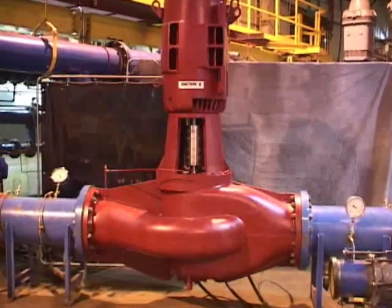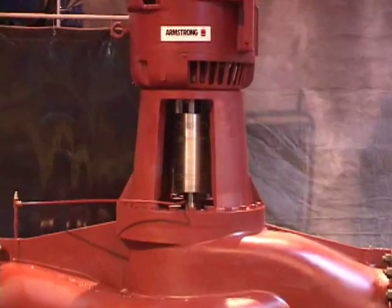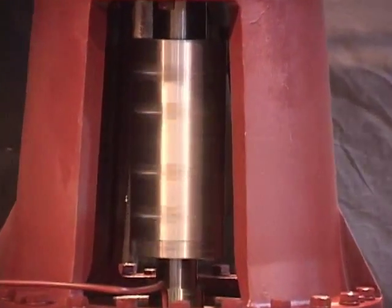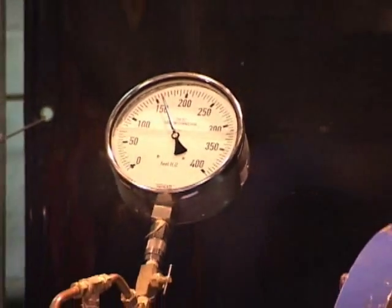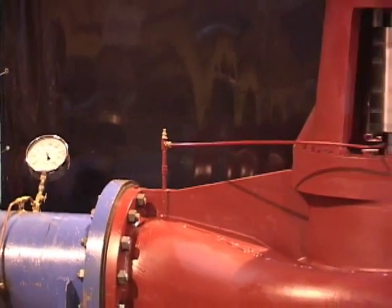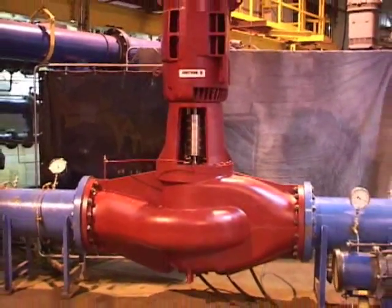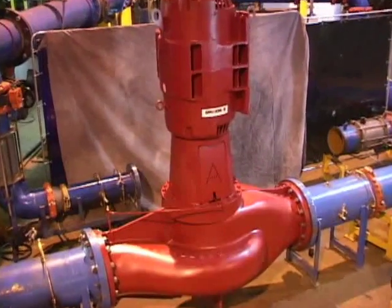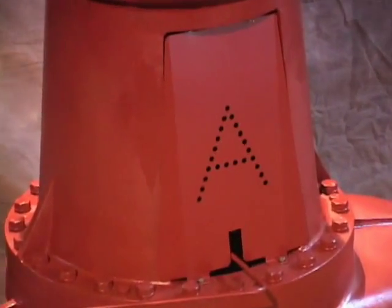In many regions, the days are gone where huge out-of-date design base-mounted pumps are automatically installed in large systems. Split-coupled vertical in-line pumps take less space, are easier to install, great to maintain, and are more reliable than base-mounted pumps by a whopping 148% in some studies. Combine this with the flexibility of installing large pumps directly in the pipe, and it's easy to understand why many system designers and operators are switching to this hard-to-beat design. We would like to thank Ben for his help in this demonstration. Thank you for taking the time to view this instructional video. I'm Niall Murphy — see you next time.